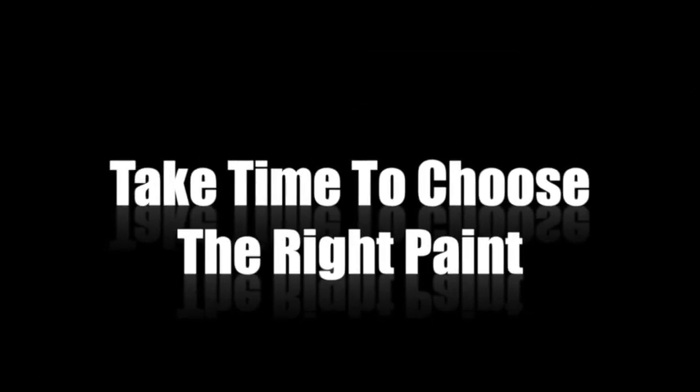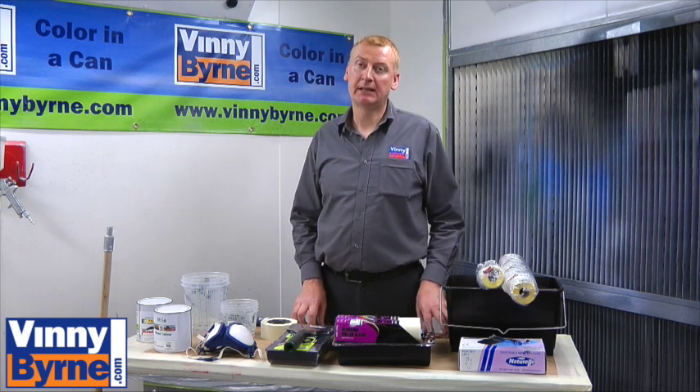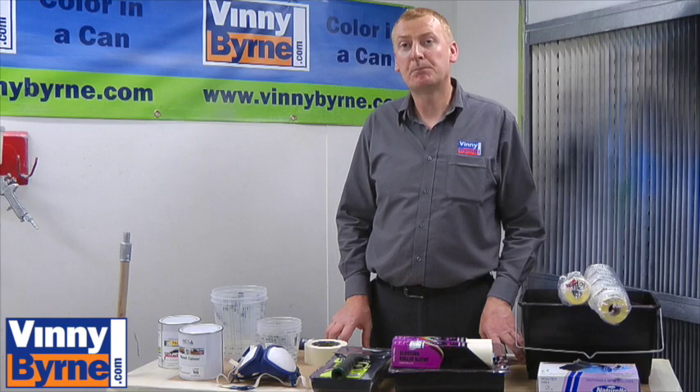Before we start, we need to identify the floor. We need to decide what kind of condition the floor is in, what type of floor it is — is it concrete, is it wooden? Also, whether it's been power floated. In a lot of industrial units you might have a power floated floor. If it is, you'll need an acid treatment to go on first so the paint has something to adhere to. If it's a standard poured concrete floor using screeds, the surface would be porous enough, so there won't be an issue with painting.